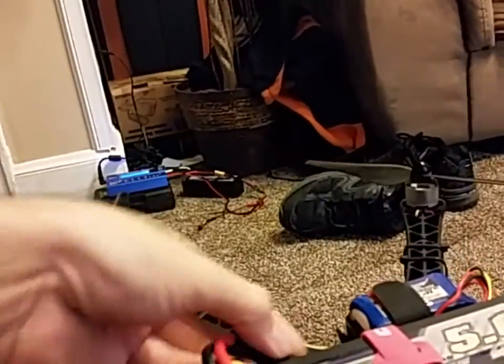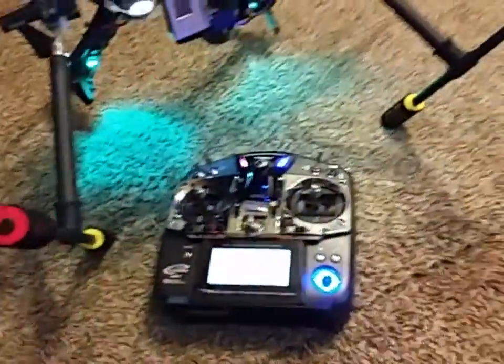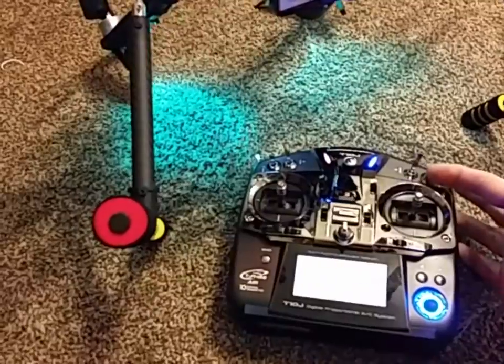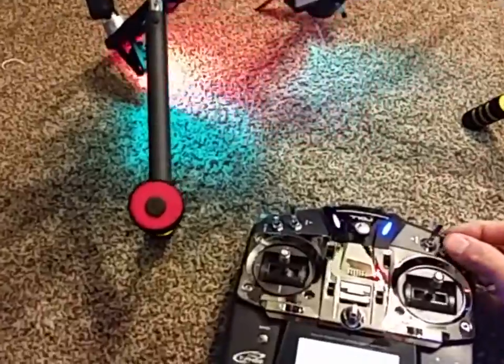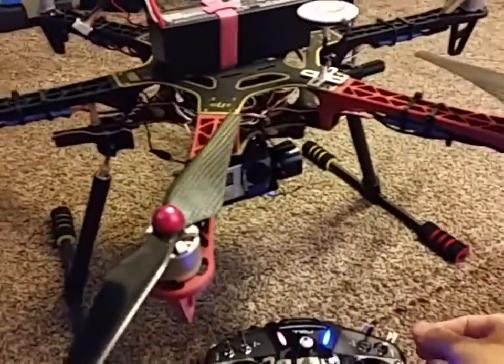Let's plug everything in here. All right, this is powering the gimbal — the gimbal powered up. Now through this switch, even in the off position the light is barely going to be illuminated — actually looks brighter than it is. The neat thing is you have to go up, meaning your lights will not be on when you first power up the machine, but they come on when you retract your gear. What I wanted was for my landing gear lights to not be on during power-up.